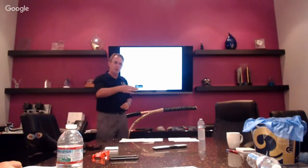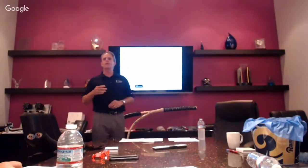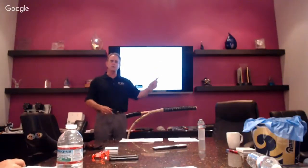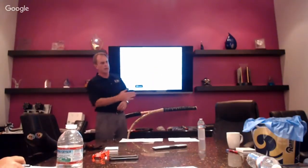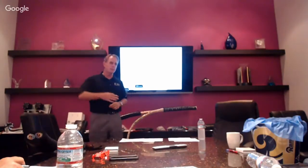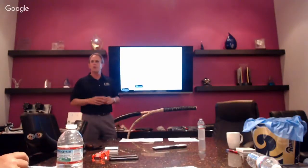But if they've got this jog in the middle, now we think we can pull the 12-line through, but we're not sure. We can do it up to the point that we can't do it. And there's no absolute way to tell you what that is, because these things can be installed so differently. But I can tell you, if you give me a 24-inch sweep going down, a 24-inch sweep coming up, and a 100-foot straight, we can pull a 12-line through that. But we can't put it in writing because we know someone's going to put a little S-turn in there or something.